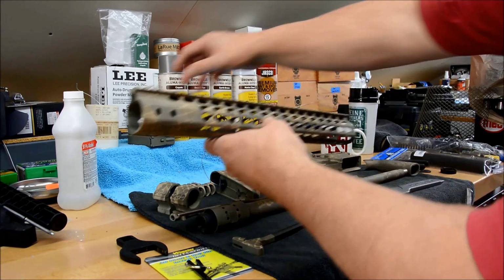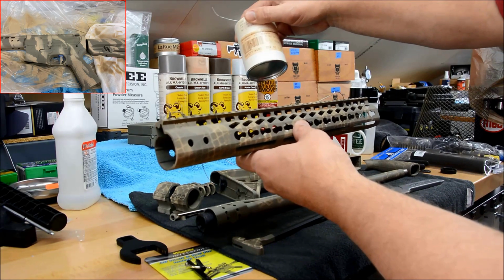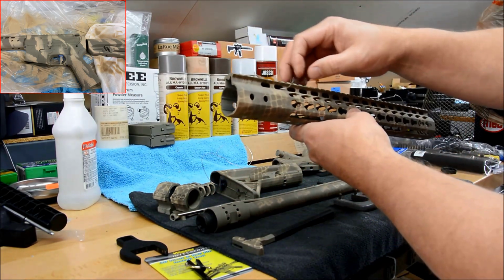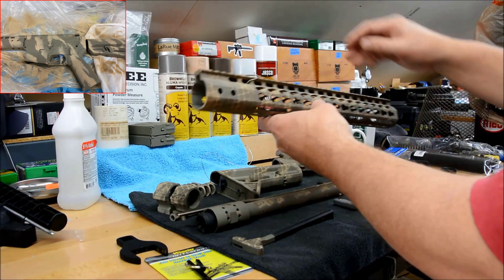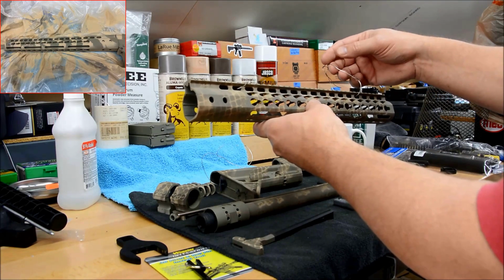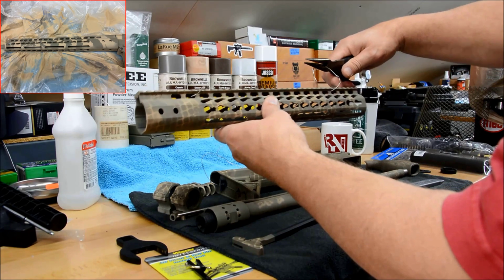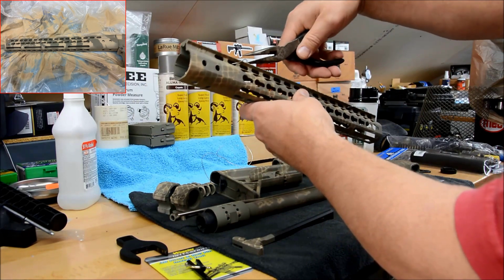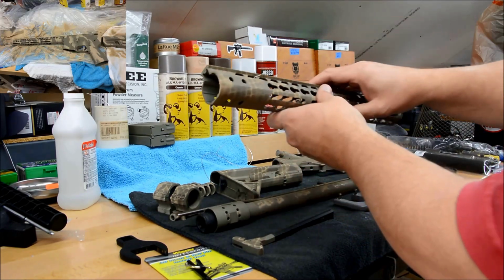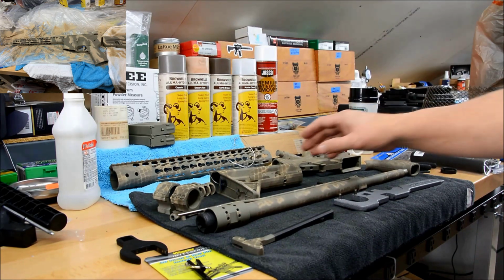This is aircraft safety wire. You can see here, it's just safety wire, .032 stainless steel. These are for tying on many things to make sure they don't come loose on aircraft, air filters and oil filters, things like that. I still have it from when I was flying a lot, and so it's really quite useful. It's soft and malleable, so you can shape it. To remove it, just a simple clip with a pair of shears easily cuts it, and then you can take it off that way. So that came out really good.